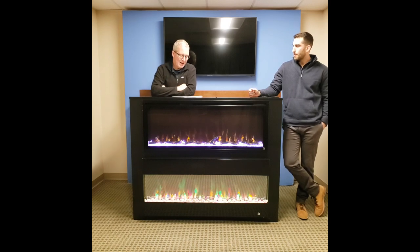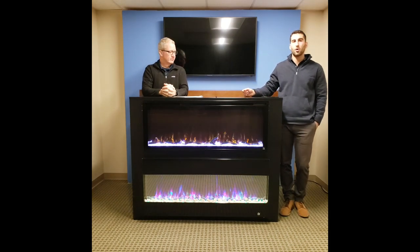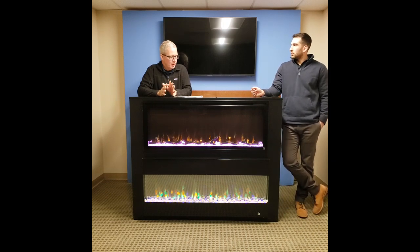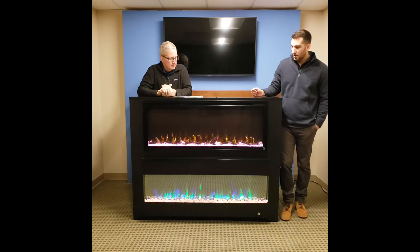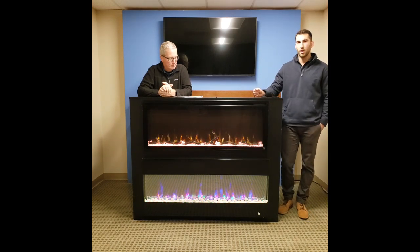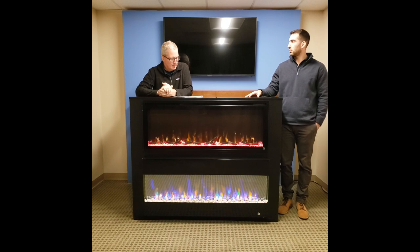What is the maximum power draw? All our fireplaces draw a max of 12 amps, so they can go on a 15 amp circuit — some people bump it up to a 20 amp depending on the other electronics on that circuit, but 15 amps is plenty adequate. On cord location: on basically all our fireplaces, if you're facing the unit, the cord exits from the lower right side. It's a six-foot cord, giving plenty of length to reach your outlet. Our recessed models like the Sideline and Fury can also be hardwired, which is helpful depending on local codes.